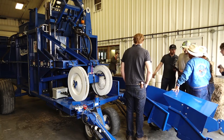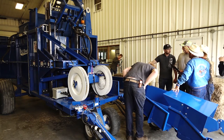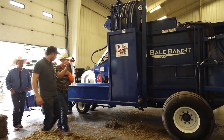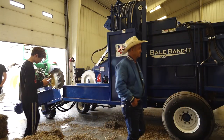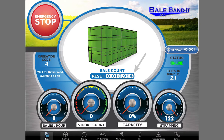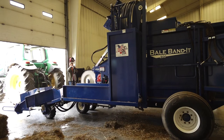When bale 12 back floor was down — it's already back up now because it's bale 14. So bale 12 back floor goes down, bale 14 back floor comes up, and bale 15 the back gate's closed. Don't confuse this — this is overall bale count, you could be baling for three years and never reset that. This is the bales in bundle. There's ten there and four on top, so at 12 it went down and dragged a bale out, then two more, and it picks back up.